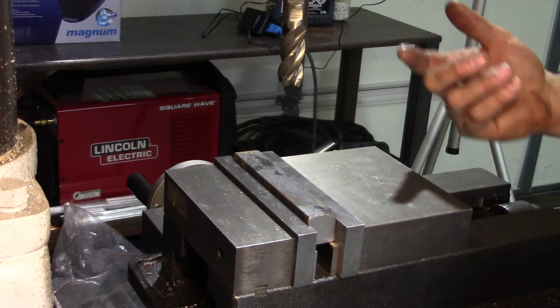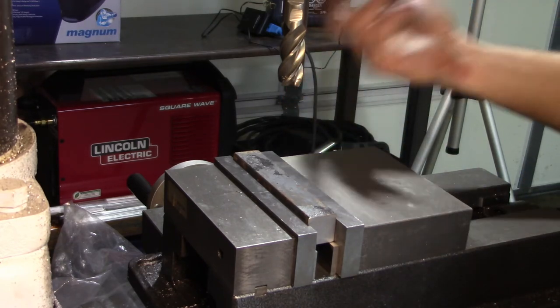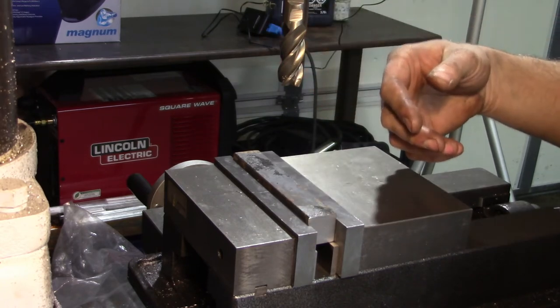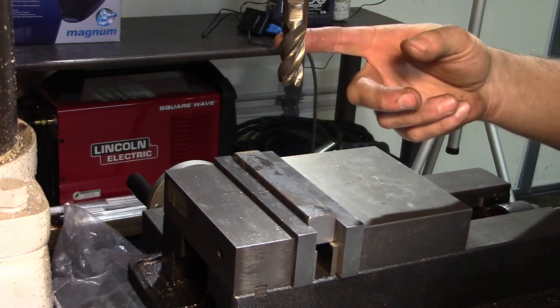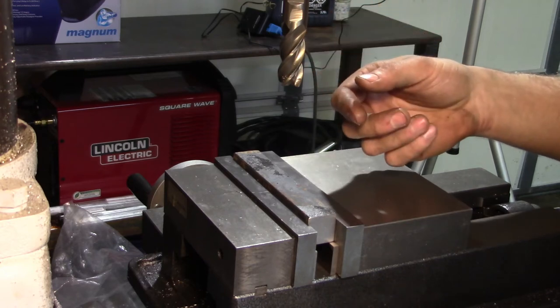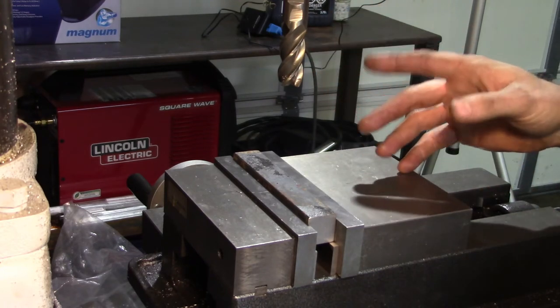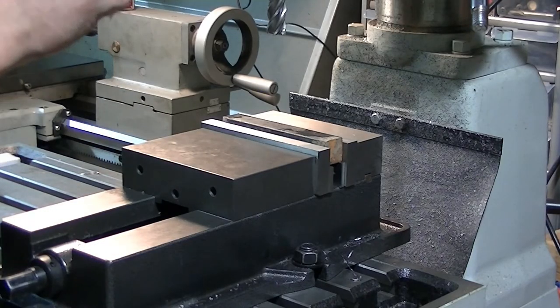Well, high speed steel in steel, you're looking 100 surface feet per minute. Times 4 for the calculation gives you 400, divided by the diameter of the tool, or the piece of material if you're turning. It's a 3/4 inch end mill, so it basically comes out to 533 RPM. The closest I have on this mill is 440 RPM, so that's what it's set to. So, without further ado,